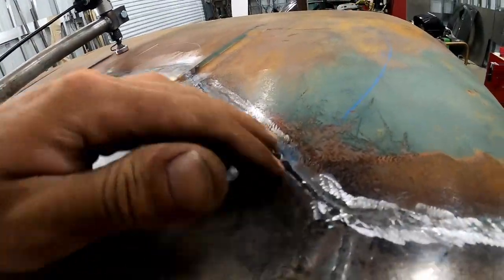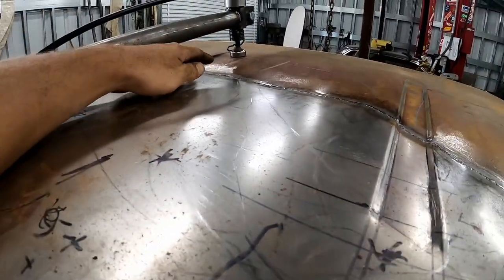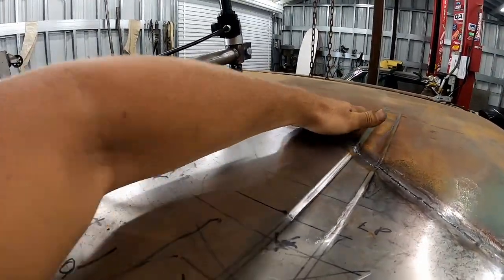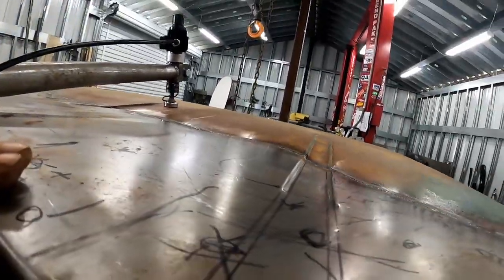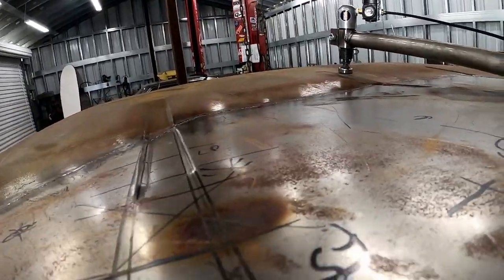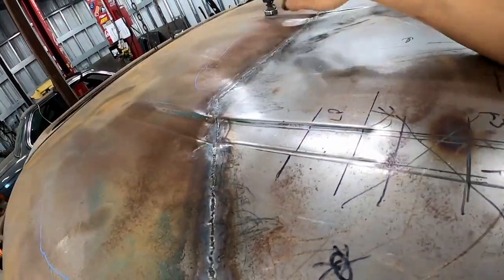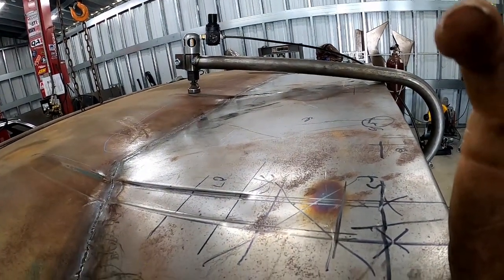It's been a few more minutes — I'm still running over the welds and I am noticing it's starting to get a little bit of a wave to it, which means the material is starting to stretch out. It will eventually get back to having a nice curve and be slightly domed instead of sunk in the middle. I am going to have to do all these portions where I bead rolled by hand because the hammer dies are too large for it.